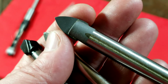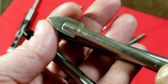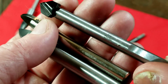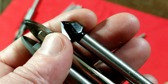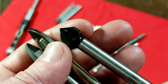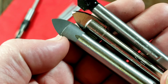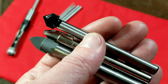Then they appeared to get cheaper, with a thinner shank and some very low-quality chrome-plated carbide. Now they've moved up to these, which are the same ones Irwin is selling, with a completely different tip style. I find these work pretty well, but sometimes I've had a little chattering with them. I still kind of like the teardrop ones, which are more progressive — right at the very end they size the hole to full size, reducing the potential for chattering.